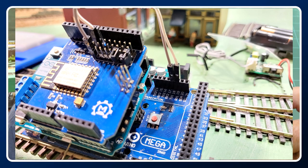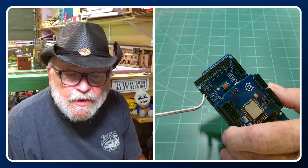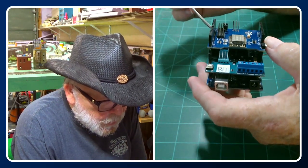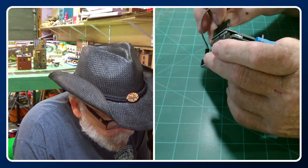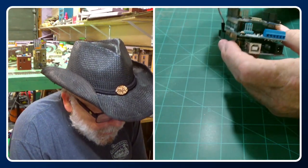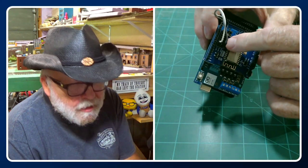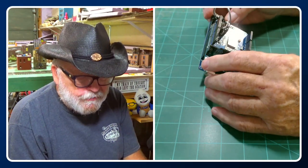You're just going to need two wires — two Dupont connectors, male to female. You can see I have them on pins 18 and 19 on the Mega. Pin 18 is transmit and pin 19 is receive. What you're going to do is put the receive on the transmit of your Wi-Fi shield. The transmit is on this side and the receive is on the opposite side. There are eight channels on here so it doesn't matter which channel you use — transmit to receive and receive to transmit.